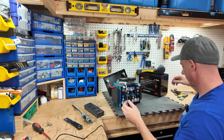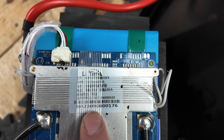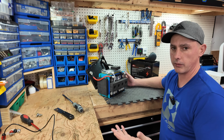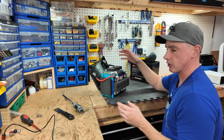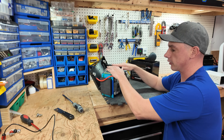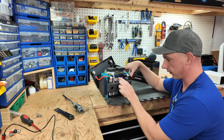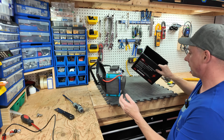Let's take a look at the BMS. It's an actual branded Lit Time BMS with the number SH23090800176. Looking at the overall build quality: it's great. We have high density foam, though we do not have low temperature protection — so if you're building a system that will see cold temperatures, I would recommend adding cold temperature protection. They have the bus bar hump for expansion and contraction, shipping straps holding it together. For this tiny little package of a battery, this is great.